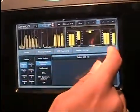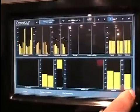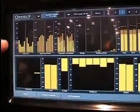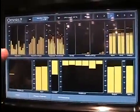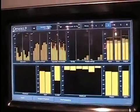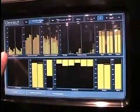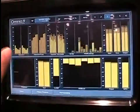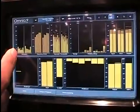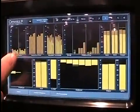Here are the meters, and now I'm going to enlarge them by pulling down on the center divider. Here's the dynamics meter. The song faded out and restarted, so they go up and down a little bit because they're continuously adjusting to the dynamic content of the music. The first bar here is a five-band expander. Here's band one — that's the lowest frequency, it's the bass — then band two, three, four, and five. Band five is the treble, for the left and right channels separately.